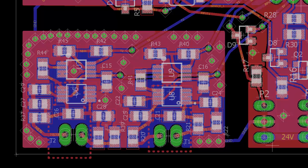And if you're familiar with PCBs, this other piece in between is the FR4 material, which is an insulator. So it's not a good conductor of thermal heat. So I removed the ground plane both on the top and bottom. And the only place the ground plane connects is these places right here on the bottom ground plane.